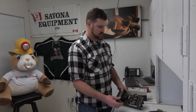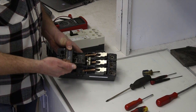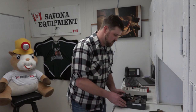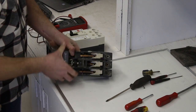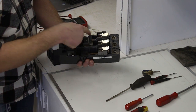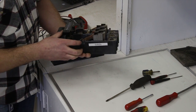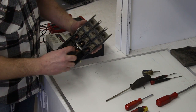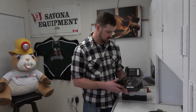When you've got it open you can also look at the operation of the breaker — look at all the moving parts, see if you need to oil or grease anything so it operates better. I'll simply open and close the breaker and you can see the contacts: they're closed right now making contact at the bottom, and when I open them you can see them opening and making the break. You can look at the mechanism here and apply any lubricant that you need.